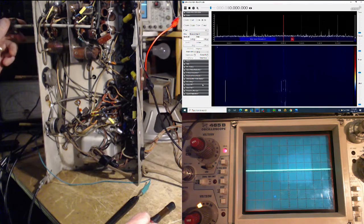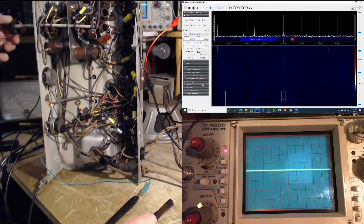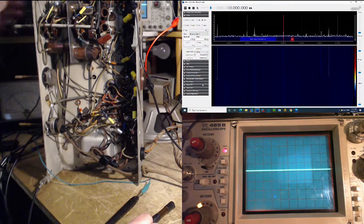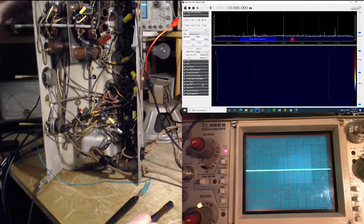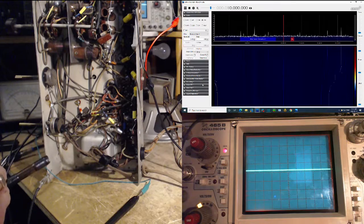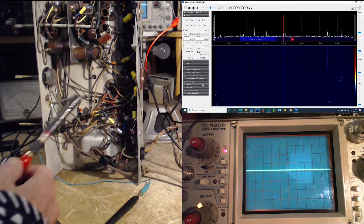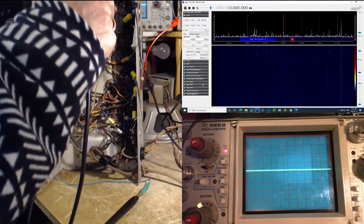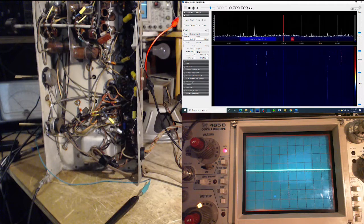Next band. Same question. Almost the same frequencies. We're now on the band spread, 31 meter band. I'll tune the radio to something nice. What's something like 9.5? 9.5, if the oscillator's below, the oscillator would be at around 9.1. Somewhere around there. 9.1, okay, it's still on the screen. Where do we see the local? 9.1's not on the screen here. Slide this over. 9.1 is right around here.